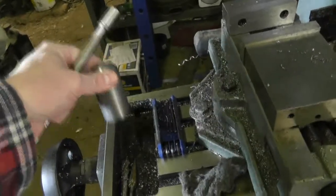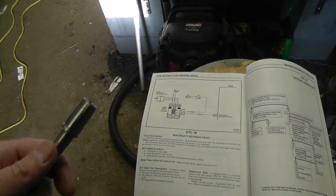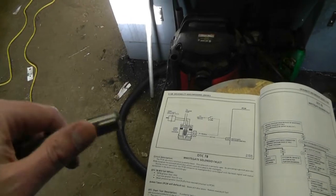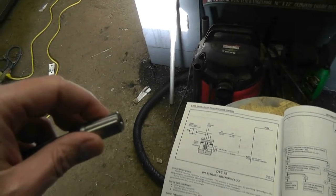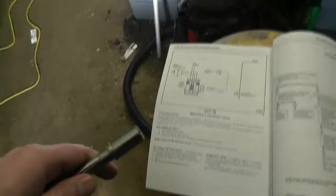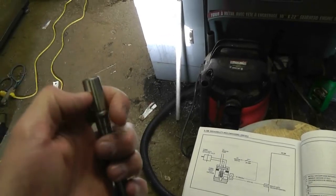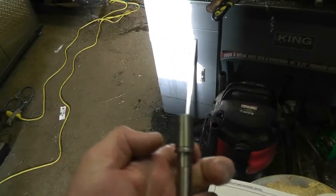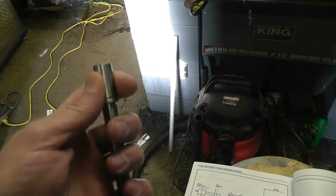And then I'll make one of these that will just simply screw on. I'm also going to have a look around so you don't have to give up on your chuck. I've got a couple of dead drills lying around, and I'm pretty sure a couple of those had threaded ends — they weren't on the taper, they were threaded. So I might be able to either make the two things the same thread, or I'll just bore out the chuck and re-thread it to whatever I thread this to. I'm going to keep this one as a sample. I won't actually modify this one because I want to make the shoulder bigger than the diameter of this piece, since I'm planning on turning about a half-inch coarse thread on the end of the one that I make.